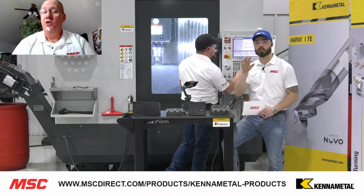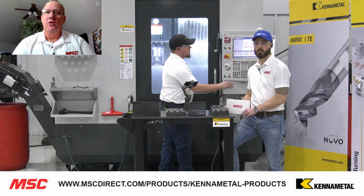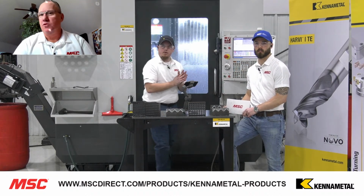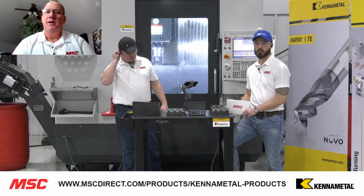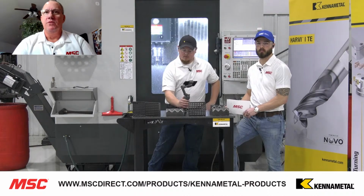Very good. And the question about coolant, I'm sorry, you had a question there, go ahead please, Tony. Yeah, the coolant through and non-coolant through, so you can get both. The smaller diameters, of course, you don't have coolant through, but typically on the mid-sized drills, you can get coolant or non-coolant through drills.